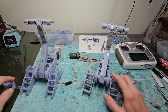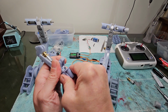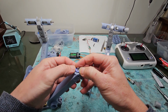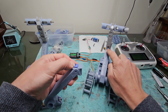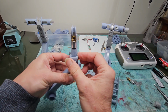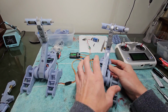This one here is the ones where you've got to have the potentiometers on. We'll just call them pods, just to shorten that. So basically, to control your motors, you need one of those. So just use this one as a demonstration. Get that off. So that would go on top like that, and it would actually get fixed down to this structure. You only want that rod, that shaft to move. On this one I have a slight modification on the torso. Then that would sit down like that, and then you'd be able to control it any way you wanted, and I'd have movement from there to there. So anywhere between here and here I can control exactly the position I want. And then you have to put that theory into all of the other motors. So this is how I'm doing it.